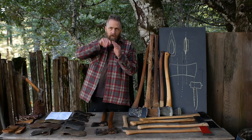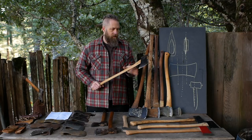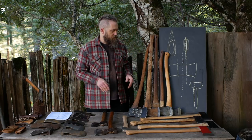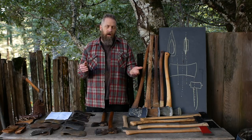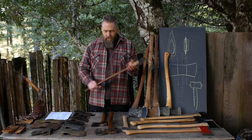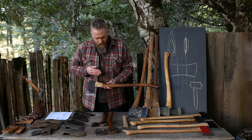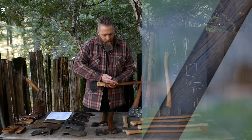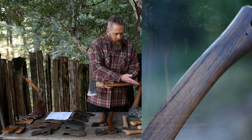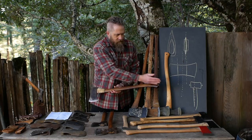The ideal is that the grain is straight and runs all the way through from one end to the other. With a curved handle you're cutting through the grain a little, and the more curved it is the more you do that. Here's a good example of run-out — this grain line starts out pretty straight but gets worse and worse down the handle, because it was cut from a curved piece of wood, then reverses and straightens back out again.